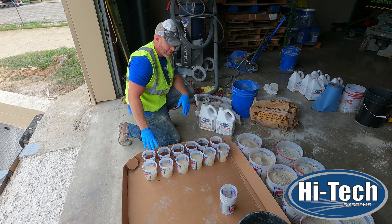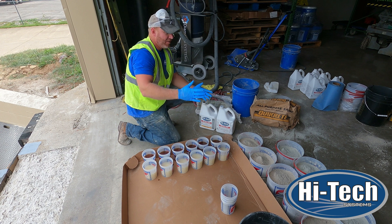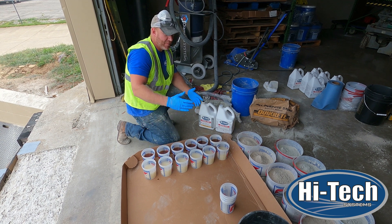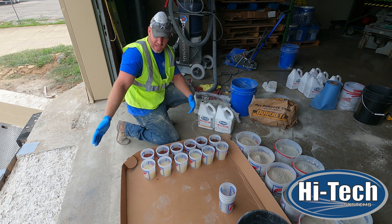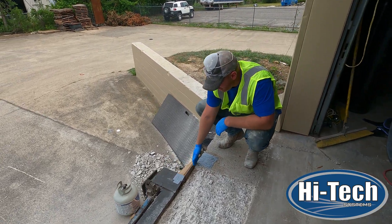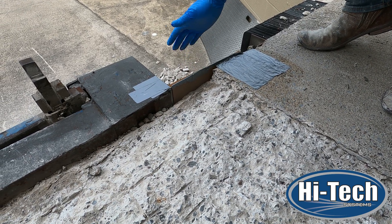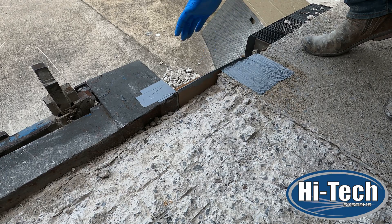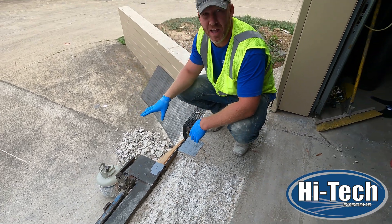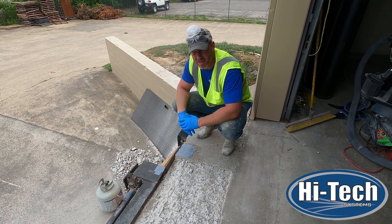We're going to do a 40-ounce mix — 20 ounces each of A and B sides — and then mix in 100 ounces of sand-cement or TruPC at a time. That's basically two and a half parts of aggregate mixed with the TX3. We'll mix this with a paddle mixer in a five-gallon bucket and apply it to the prepped area. We had some sections where the wall was completely blown out next to the dock plate, so we've used thick cardboard with duct tape and a brace behind it as a dam to prevent low spots. We'll pour the TX3 mix in and be ready to grind in about 40-45 minutes.